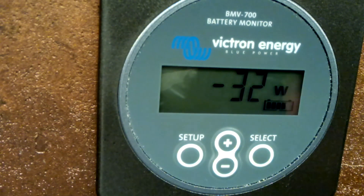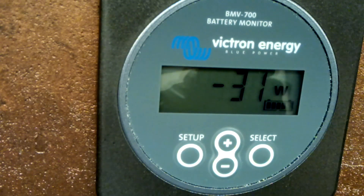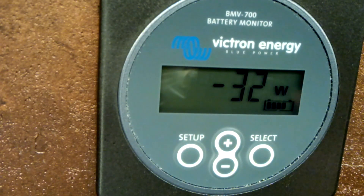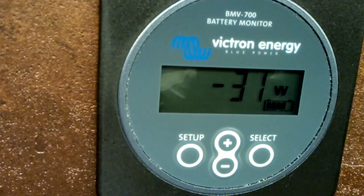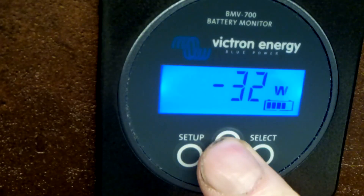There's also the problem that when you buy batteries or cells, they claim 200, 300, 150, or 100 amp-hours of capacity, but you don't know the true actual capacity. Because battery capacity is one of the essential settings, sooner or later we have to set it properly, at least within a few percent. Here's how I do it using my favorite reading.